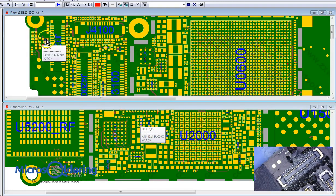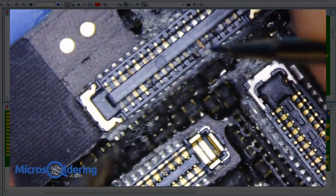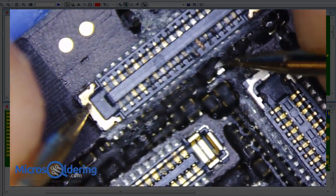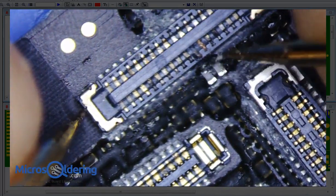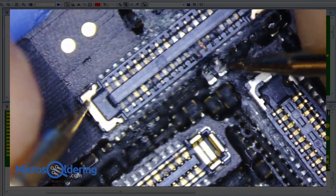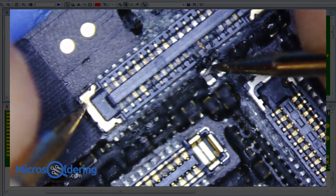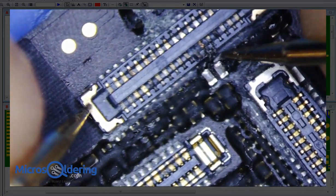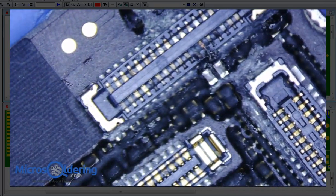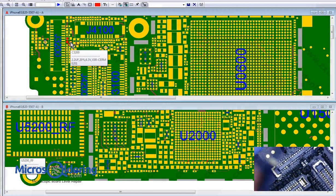And the one, I don't know what that is. Where does that even connect to? I don't know. All right. So let's just check this one right here. So let's just make sure this is not. Otherwise, I just won't remove it. So this is shorted too. So something is shorted under there, I believe. Well, you know what? It's not shorted now. Oh, there we go. Weird. Are these filters? Let's double check. No, these are caps. So this is a bad cap right here.